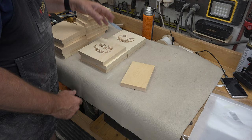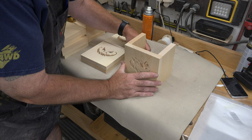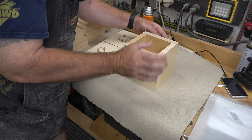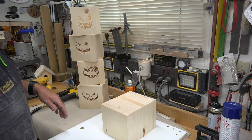Now it's time for some assembly. We're going to take two of our four inch wide pieces, glue them, and I'm probably going to use some brad nails to help with the assembly. I'll shoot a couple brad nails in and glue a backing on it just like this. Once we get that glued up we're going to clamp it together and sit it aside and let it dry overnight. Our boxes are dried up — it's actually the next day.